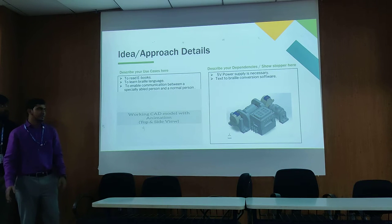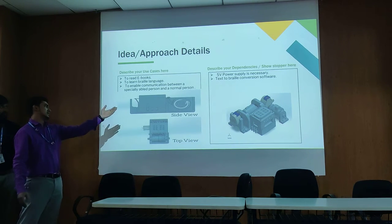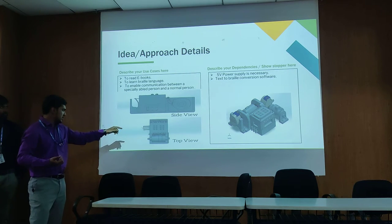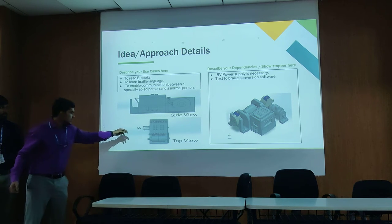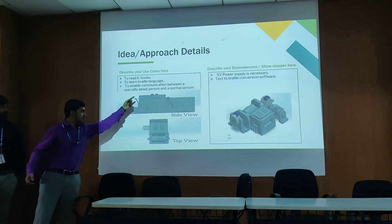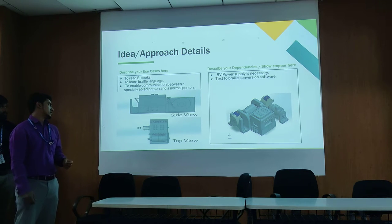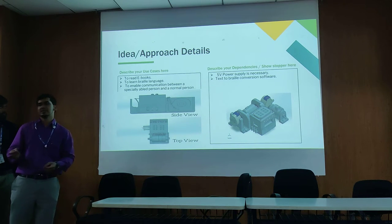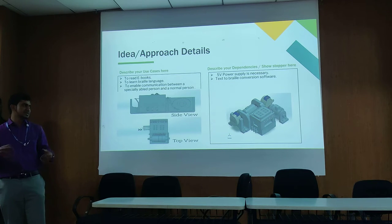This is the top and side view. It pretty much explains the working. So this is the cam which will unlock the locking plates. The pin will be pushed by the springs. These are the comb springs which will actuate. So you can see this, and these are the pins coming up. This works on the principle of a matrix. Every individual dot is controlled individually. This is what makes it simpler and affordable.